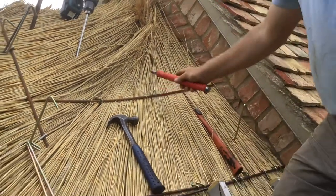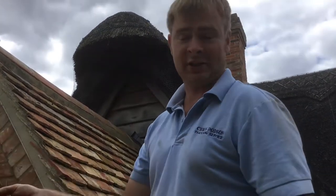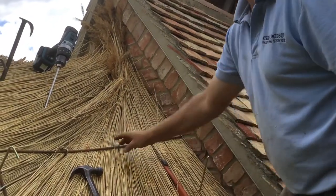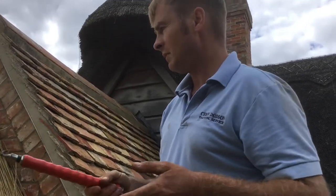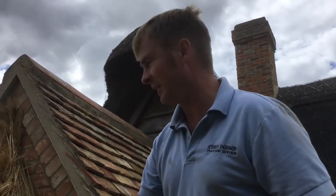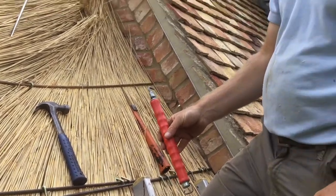These are quite good if you've got an old roof which is well shaky with plaster. It doesn't take much — if you miss with a spike — to make the inside of a roof look like a war zone by just breaking the plaster. But spikes do hold the reed tighter. The advantage is they can be driven into any type of wood. This is an oak frame porch — I'm only putting this in for demonstration purposes, I will have to have a spike in there to hold it down. It's up to individual choice. I personally prefer to use spikes where possible — I just think they hold a bit better. But there's nothing wrong with using screw fixings provided they're in the right material and holding tightly enough. The key thing is the distance between the face of the thatch and the fixing steel — there should be at least four to six inches worth of covering on that main coat.